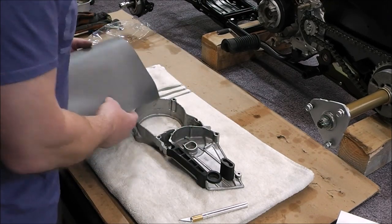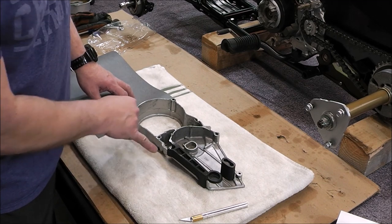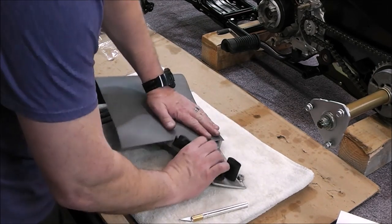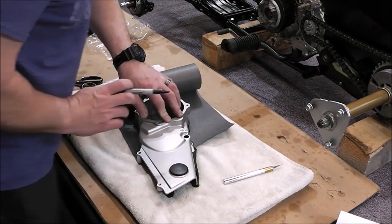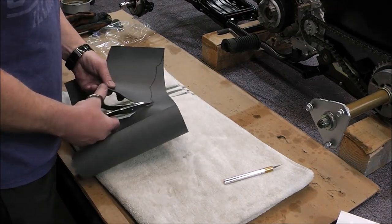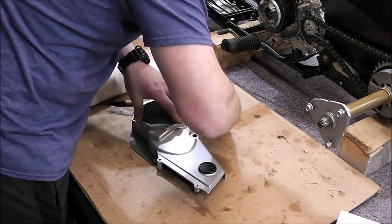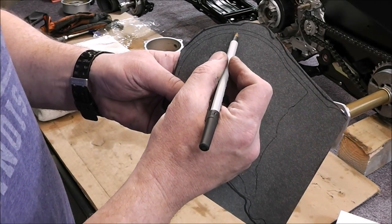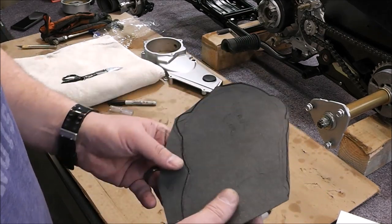I make gaskets in all different thicknesses and material types. First I lay it out to get the most out of the gasket material I need. I'll draw a quick shape of that and cut it out with scissors — that's my rough shape right there. Now that I've got it roughed out, I take a nice sharp pencil and just trace out the outside of it. I trace the inside and the outside. I take the line on the outside — so you don't see the gasket protruding beyond the case — and leave the line on the inside. Then I just cut that out with a pair of sharp scissors.